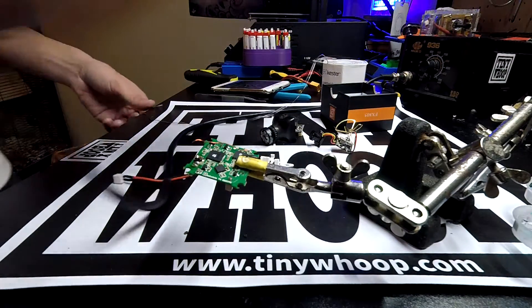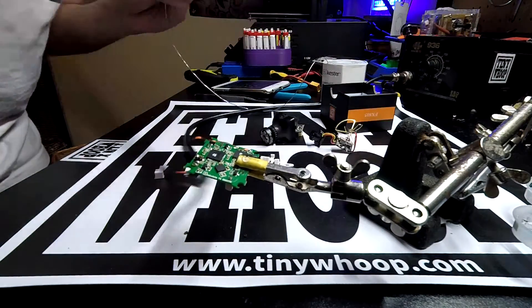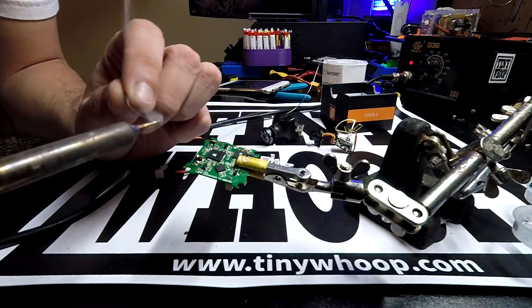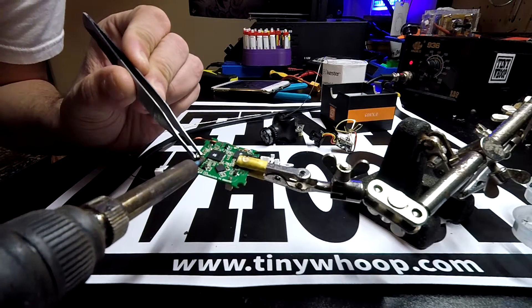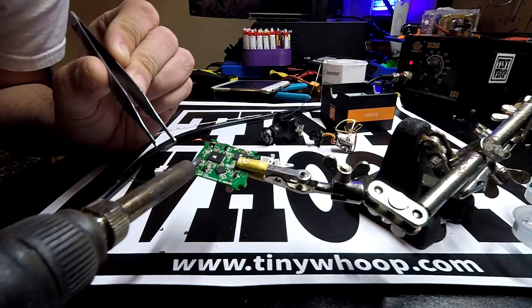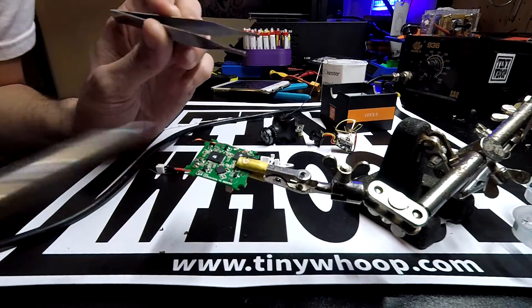The best thing to do is to hit it with solder until it moves, then grab it with your tweezers, because the tweezers actually absorb some of the heat while you're doing this and it makes it kind of tricky. I'm going to tin it up a little bit — that makes it a lot easier to get off. There it goes. So now we are left with two pads here.